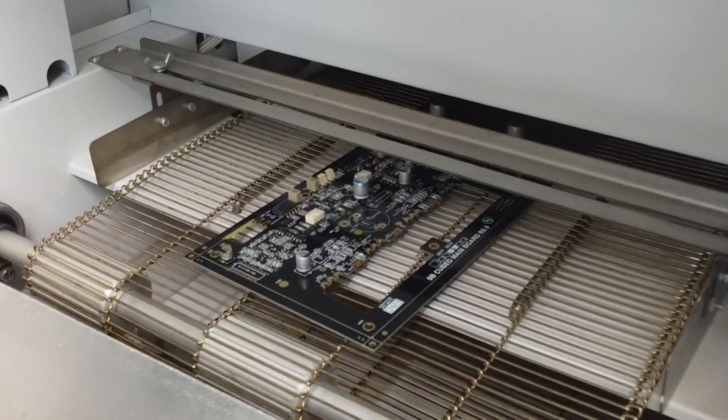The entire circuit board with the components and the solder paste is heated so that the solder paste turns from its crumbly paste-like state into molten metal, forming a solid permanent electrical connection between the component and the pads on the circuit board. This process takes place in what's called a reflow oven — basically a long covered tunnel with a conveyor belt running through it, containing heating elements and heating zones at the top and underside of the board, along with fans to precisely distribute airflow.